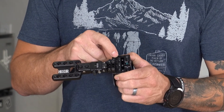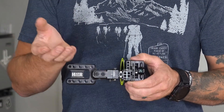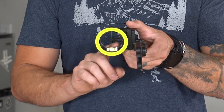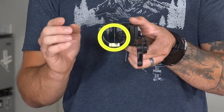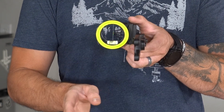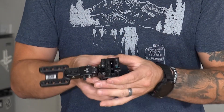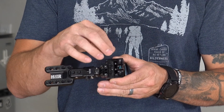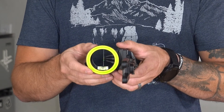As far as moving your pins, basically you have two set screws for each pin. As you tighten or loosen them, that pin is going to come up and down depending on where it's aligned inside your housing — it's going to either pull away or shoot past the center wire. That wire keeps all your pins in line. To move a pin back in line, there's a screw on each pin; back it out or tighten it and it's going to move you over to the desired position right in line on that wire itself.